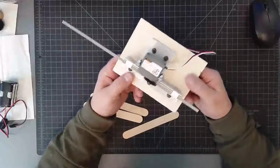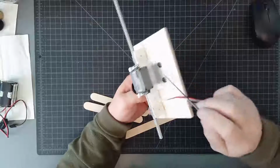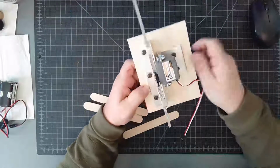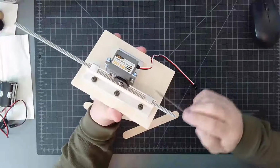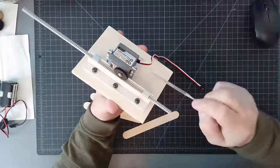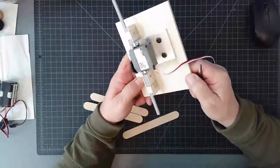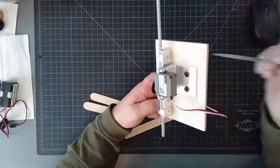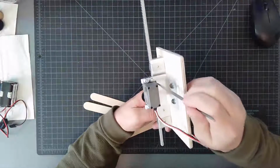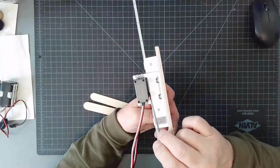Then for my motor mount, I did the same thing. I'm using all the same process that you use to make your mini-me, essentially, except I used the 2-inch angle aluminum because I needed height from my base to the center line of my pinion gear. So I used the 2-inch, and I did the same thing we would do when we made the mini-me's. I made a cut from the top down a certain distance. See that? And I did the same thing on the other side. I'm going to bend that back just by making a scribe.